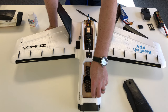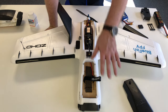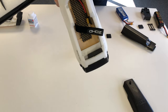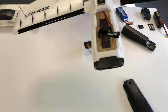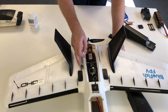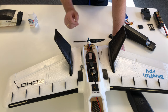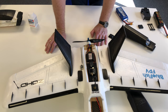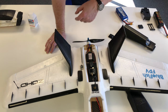I also put a piece of foam in between the LiPo and the back of the GoPro, so if there's a crash and inertia pushes the LiPo forward it won't smash into the back of the GoPro and break the rear screen. The only other notable thing on top is the usual JJB lost plane finder, powered by its own LiPo with a flashing LED and buzzer that flashes for a few hours. So that's pretty much everything I've done to it. I'll move on now and show you inside the cover and how that works.